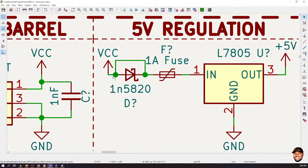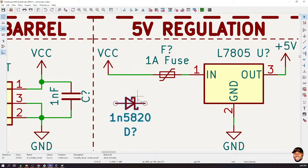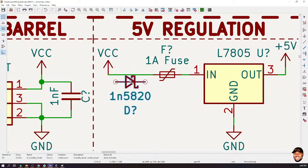If you don't expect to see this, this round dot shows that more than two connections are at that place. Anytime you see them, we call them junctions. Anytime you see a junction and you know you are not expecting a junction, please pay attention to it.